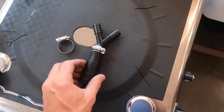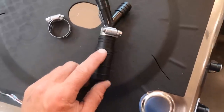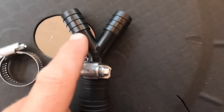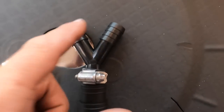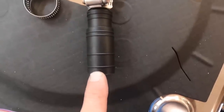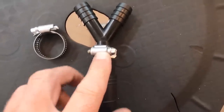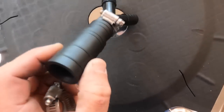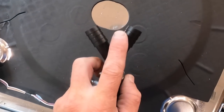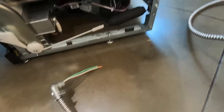I'm going to hook up my two dishwashers. I want them both to go into the garbage disposal, but there's only one connector on the disposal, so I ordered a barbed Y-connector — one dishwasher drain comes in one side, the other comes in the other side, and then it has a dishwasher adapter that hooks onto the garbage disposal. I got that clamped on, and now I can climb under there and clamp it to the garbage disposal.